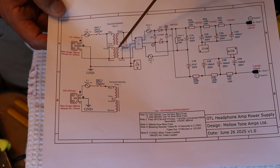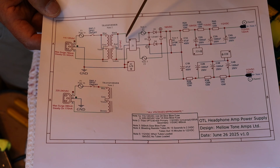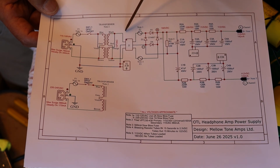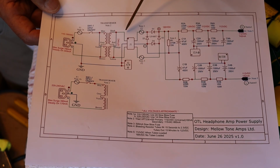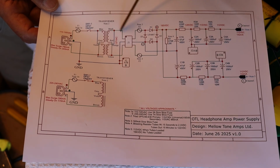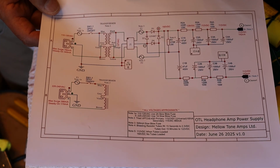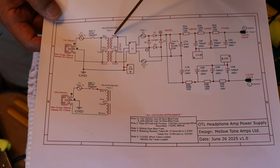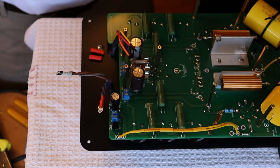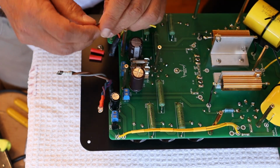And that's what we're going to do, because we're building a power amp and we need current. And one of the good things about the 6AS7 6080 tube is that it actually runs really efficiently at a lower voltage, and it can push current. So that's why we're going to be configuring this in a parallel configuration. And that's why it's so important that we get the black and orange connected up. So we're going to do those first, and then it's going to be hard to mess up the other pair since there'll only be 2 wires left.